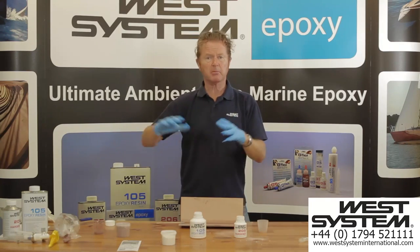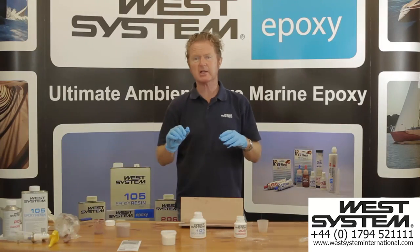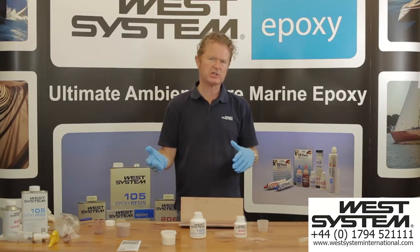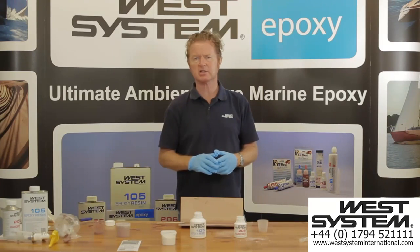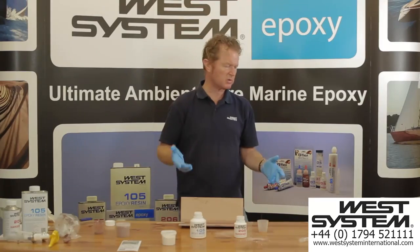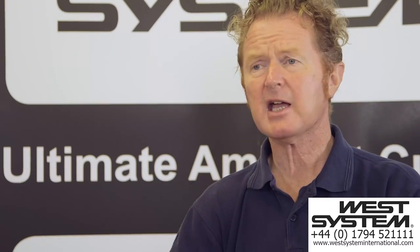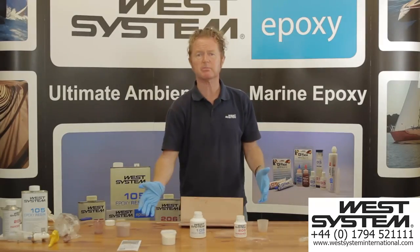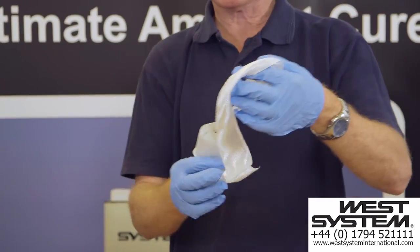Mirror dinghies from old were constructed using stitch and tape methods, and they always use polyester resin. Polyester resin is a very, very poor adhesive against timber, against plywood, and it is not very effective when used with glass tape. Epoxy, on the other hand, West System Epoxy is the most amazing adhesive, and it will work with all of this range of powder fillers, and it will also work very effectively with glass tape.